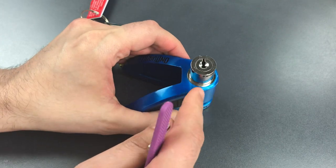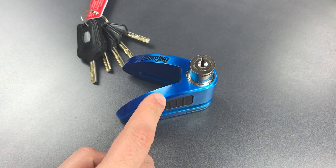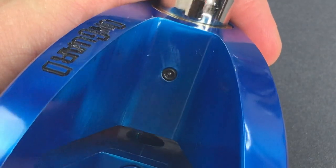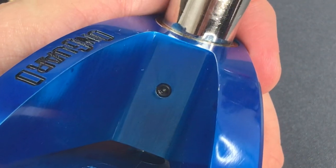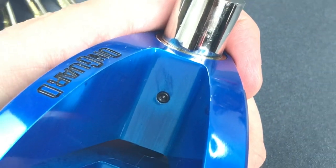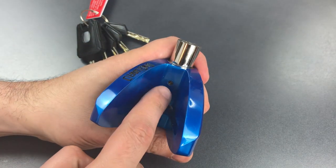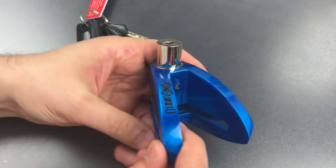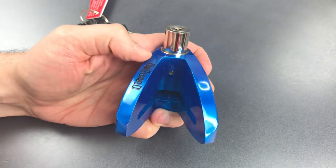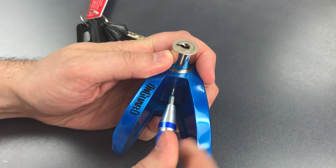So that wasn't too bad. Before I take it apart, I should note that this lock is not designed to be disassembled. If we look at the screw that allows us to take it apart, you can see that there is a ball bearing that is hammered and epoxied in place. However, when they did install it, they installed it a little bit too deep, so I can still get a bit on this. Fortunately, this doesn't compromise security, but it is a quality control issue. So let's take that screw out, and then we'll be able to remove the entire core.